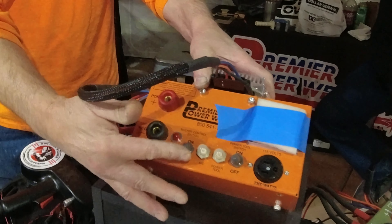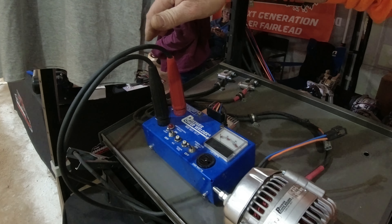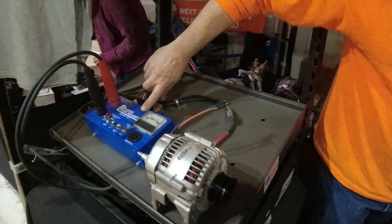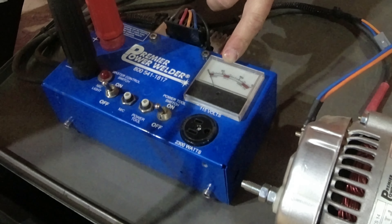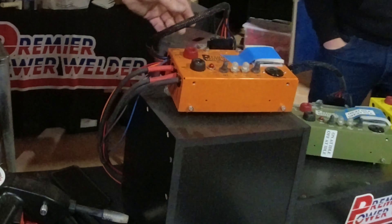When you turn the welding system to the on position, you put your welding leads in place, bring your RPMs up, and the gauge is going to come up into just before the red area where it says weld. You're going to stick weld — try it a little bit, make sure it works. If it works, go for it and do your welding and repair. You need more heat, you increase your RPMs, which brings you up into a higher amperage and voltage. You need less, you decrease your RPMs. When you're done, idle back down, turn the system off, and hit the trail.